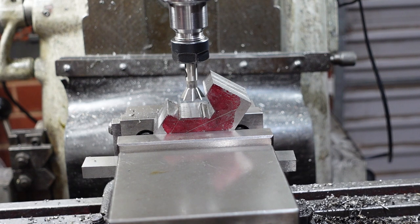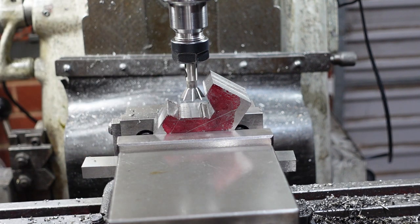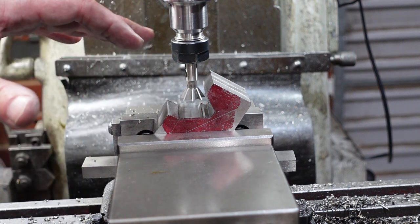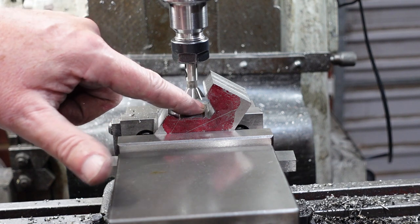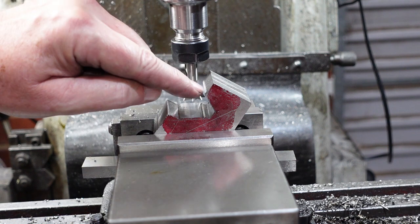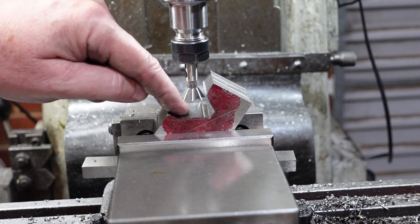This is the plan to get rid of that pesky undercut. I've lined up my cut line here with the parallel above the vice, and I'm going to do some filing on that later on - as long as I get it reasonably close, I don't mind. To get past this undercut, I was looking for a T-slot cutter and I happened to find this dovetail cutter, which will do just as well. It's got enough stick out to clear that small lip there. It doesn't need to clear by much - it's only a couple of millimetres - but that should be enough to get past that and give me a relatively good cut on that surface.